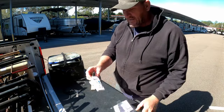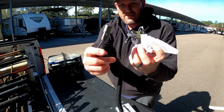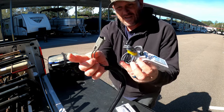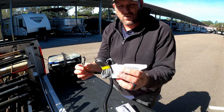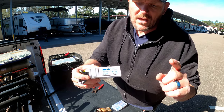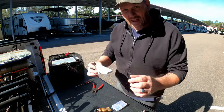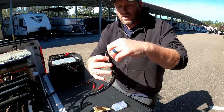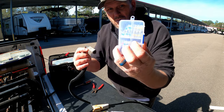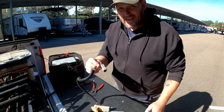Alright guys, here's the new one and the old one. As you can see, this one has a plug on it that'll attach back in there, and these are bare wires, so we just have to switch this connector over to the new one. This is the Rule-o-Matic float switch, Series 35A — I'll leave it linked in the description below. Basically I'm just going to cut this one off and solder it back with these heat shrink soldering connections. Super easy.